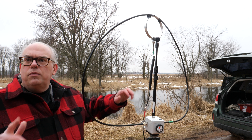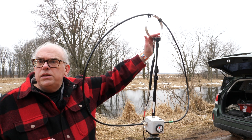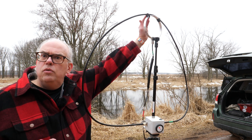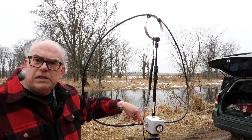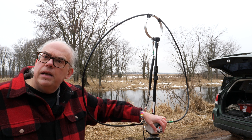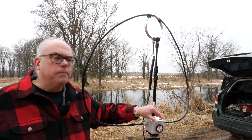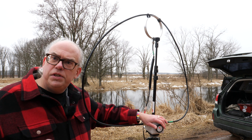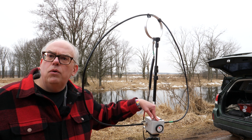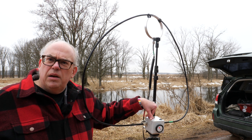The coax comes up, we've got an RF choke, and it feeds into this small six-and-a-half-inch loop, which then is inductively coupled into this larger loop made out of LMR-400 coax. That feeds into this box, which has a tuning capacitor in it. There's a knob on the front so we can use an antenna analyzer or SWR bridge to tune the resonant frequency we'll be operating on. The first limitation is power output — because this is an air capacitor inside, you're not going to be able to use a lot of power, otherwise you'll get arcing along the capacitor plates. This antenna is rated for 20 watts SSB and 10 watts CW and digital.